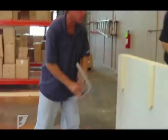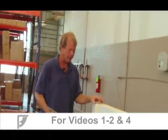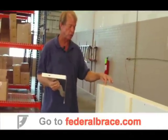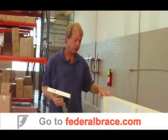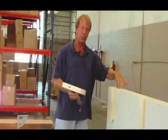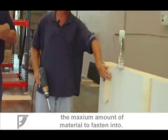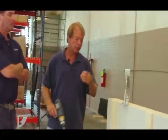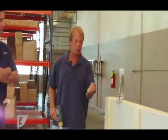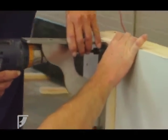With this bracket, we need to consider the bolt length. We've got a quarter-inch backing bracket, three-quarters of an inch board, half-inch sheetrock, and then inch-and-a-half blocking behind it — so inch-and-a-half lags aren't long enough. We need to move up to a two-inch lag so it goes through the board, through the sheetrock, and into the solid blocking, which gives it plenty of support. If you're using a thicker product, you'd want a two-and-a-half or three-inch screw. You want the screw biting at least one inch into the blocking.